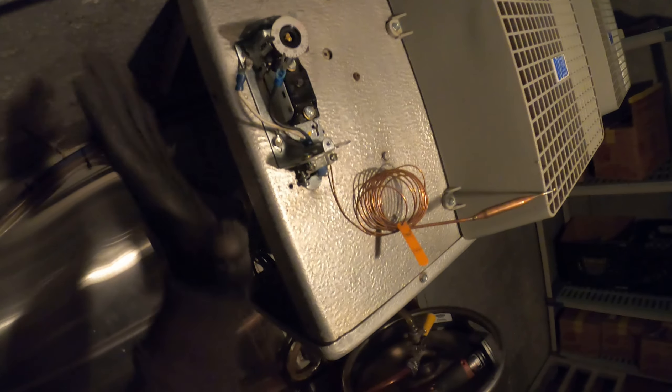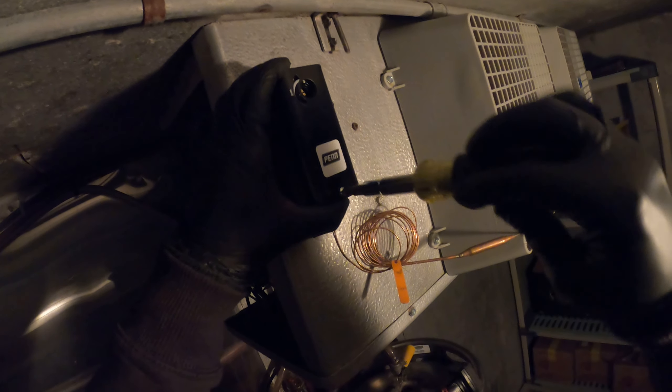The control is now mounted. I'm just going to close these up — these are the connectors for this wire, just so everything is nice and in place. That looks so much better. Controls mounted, wires are secure. I'm going to loosen these terminals here and wire this one the same way the first one was wired, making my connections and tightening them down. Connections are nice and tight. Put the cover back on and tighten down our locking screw.